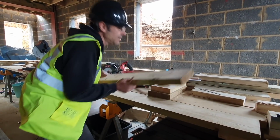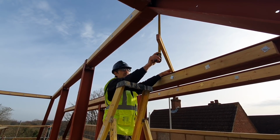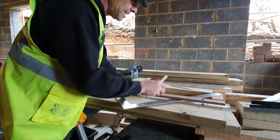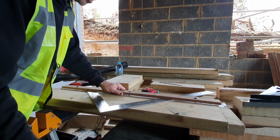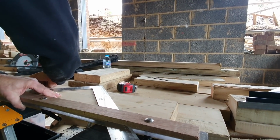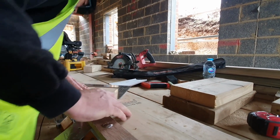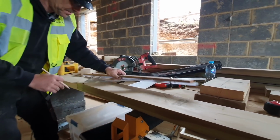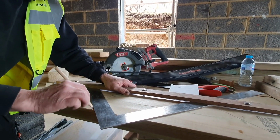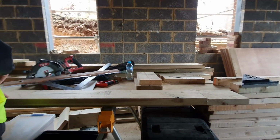We now know the height from that steel up there that we showed to the next steel. We know what that is. That was 642. So we'll step that off. Stepping off is using the scale here to measure it. So we go 300 and 342. So that's effectively the steel below, and that's the steel above, and that's running at 45 degrees.